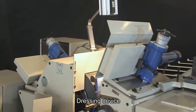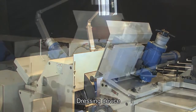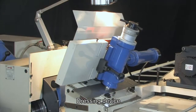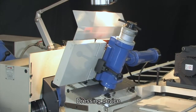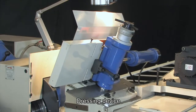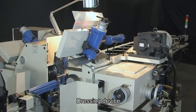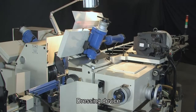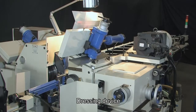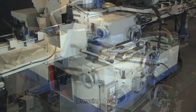This model uses FC30 high-grade casting iron on the wheel dressing device and is precision ground and built. Hydraulic driving and stepless speed is good for even compensation. The regulating wheel can also be adjusted according to the different work properties to achieve finished products with real straightness and high surface quality.